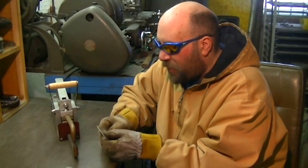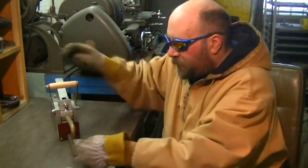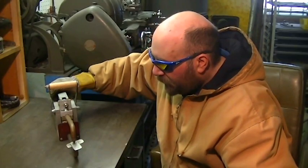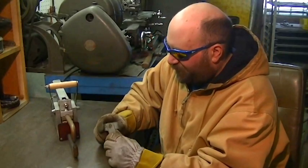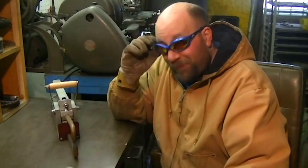Let's give it a shot with just the two pieces, and make sure there's nothing wrong with the spot welder itself. I'll give this a decent pulse. A lot more color in that. Yeah, that's not moving. So apparently, at least with this Harbor Freight spot welder, going through more than two pieces of material can be problematic. I would stick to just two pieces. Well, I hope you learned something — I know I did.